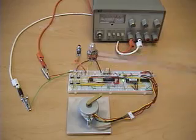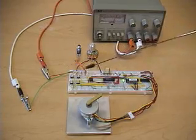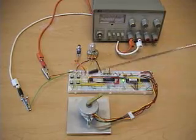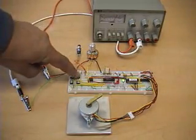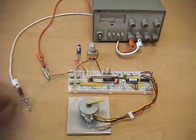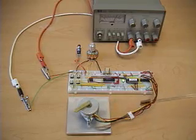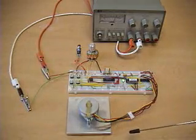The four position buttons position the motor at the current position (the first button), at the 45-degree position (the second button), at the 90-degree position (the third button), and at the 180-degree position (the fourth button). Here we move from the 45-degree position back to zero degrees. That's the fourth button moving to the 180-degree position, and you can see the motor taking one step at a time. This particular motor has 7.5 degrees per step.